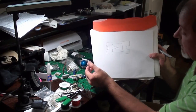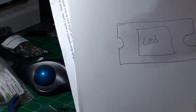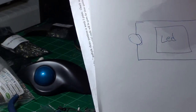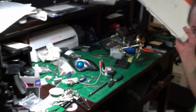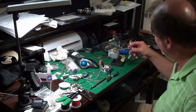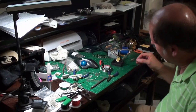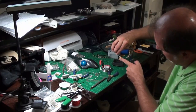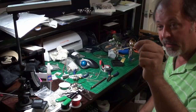Your LED looks like this — it's got two notches on either end. What I did is I took my wires, stuck them in those notches, then soldered it right there so the wires project back off of it. My helping hands wouldn't hold the LED, so I put some tape in there — on the non-sticky side, just the tape was enough to hold the tiny leads. The leads were made from clipping the ends off resistors because I didn't have thin enough wire.